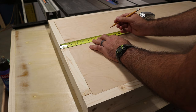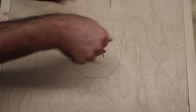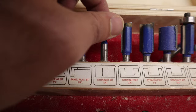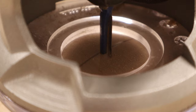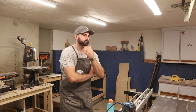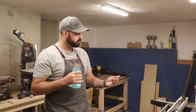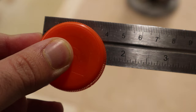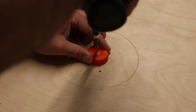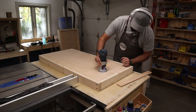The next step was to cut out the hole. This needs to be a 6-inch diameter hole set 9 inches from the top and 12 inches from the side on center. I marked out the location and used my compass to trace the circle. To cut it out, I wanted something more accurate than a jigsaw, so I grabbed my router and a quarter-inch straight bit. I lined up the router bit to the circle, measured from the edge of the base plate to the center, and found a circular object matching that distance to run the router around — a bottle cap. I drilled a hole in the center of the bottle cap, screwed it into the center of the circle, made a few passes with the router, and then knocked out the circle.